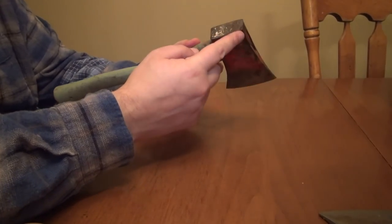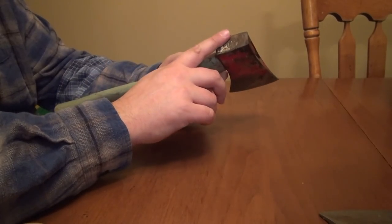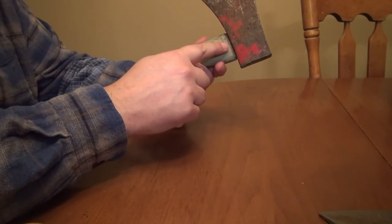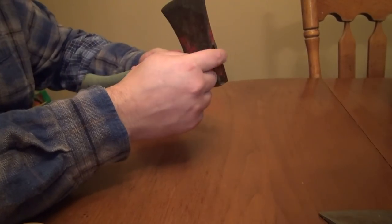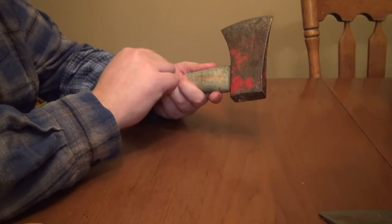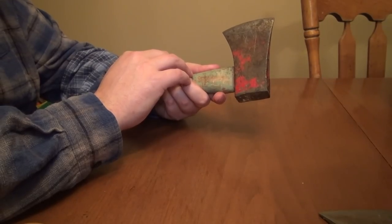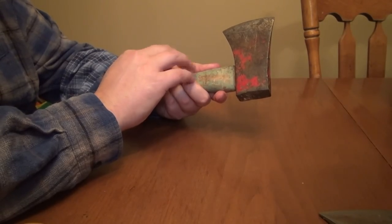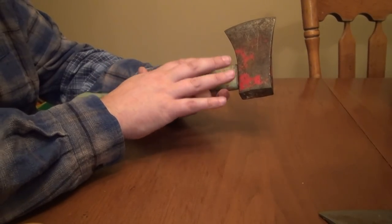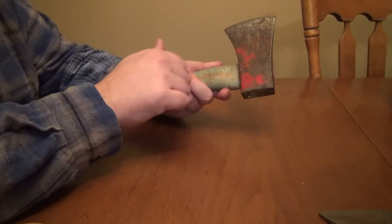The pole shows an obvious sign of heavy use — fracture and actually compaction. That would want to be cleaned up, leveled off nice and flat, and rounded over to strengthen the bit in terms of future impacts. The head is slightly starting to come off the haft a little bit, and you can see it's actually shrunk down if you look inside the bit. However, this is a relatively old axe and it's very slow movement — it hasn't moved like that in at least half a dozen years. Normally I'd take the head off and re-haft it, but this is a very nice old handle that mightn't survive that, so I'll just note to the owner to keep an eye on it.